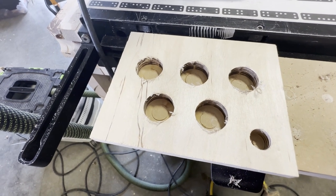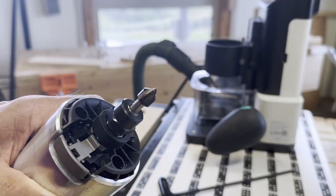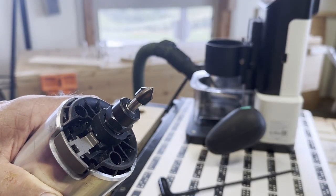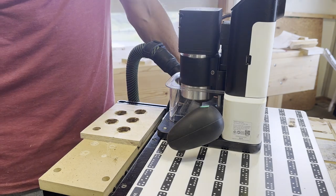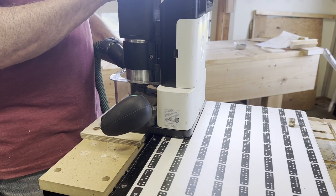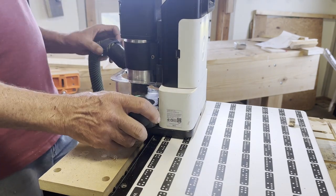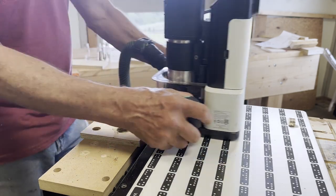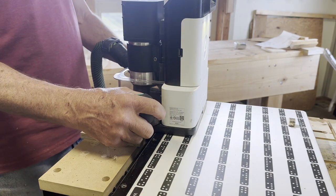Here's the top - the holes are cut through. They're kind of ragged from the upcut router bit I was using. So I'm going to make a little chamfer with a 45 degree bit and that's going to clean those up. I have to Z-touch the router to make sure I don't go too deep. I think I went down 6 one-hundredths of an inch or something on these little chamfers. I just have to go around each circle to clean that up.